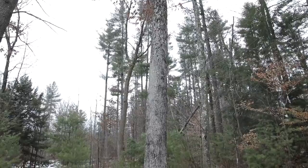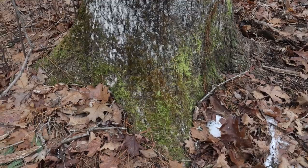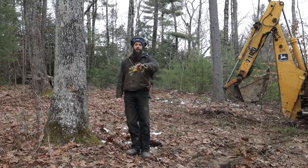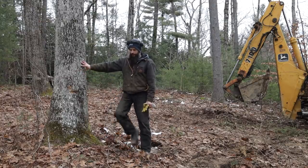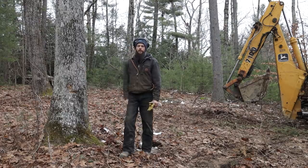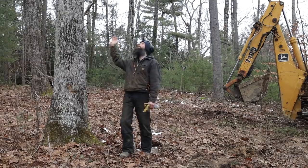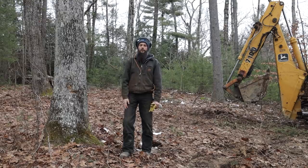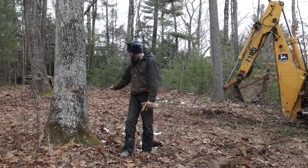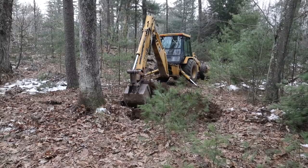So next up is to harvest this oak and its knees down here. This looks like it might have some pretty good ones. So I'm going to put the backhoe where Alex and the camera and you all are right now, and undercut on this side and dig out past these knees a little bit and get down underneath the root ball. And then I can move the backhoe to the uphill side, scrape those away a little bit, and then hopefully just use the tree as the lever and push the whole root ball over down the road here. And then we can cut it up, clean it up, fill in this hole, and get to cleaning up and cutting out these stumps.